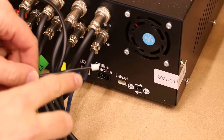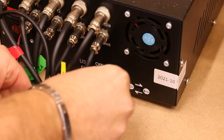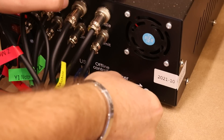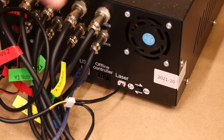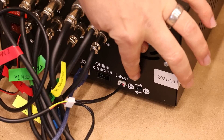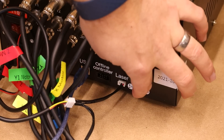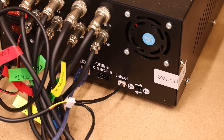The setup is really simple. You connect the power pack to the open end connector — there's an open JST connector — which you connect the existing laser cable to and click it in place. This is the cable that now goes into the back of the laser instead. You've got to plug it in to draw the power, but it just guarantees you can run this at 100% no matter what setup you're using. Also remember, if you have a switch between a laser and a spindle, switch that over to laser to ensure everything runs correctly.